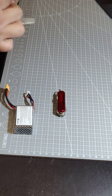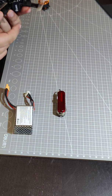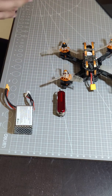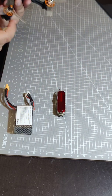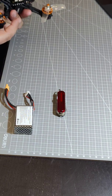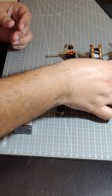However, when I was first setting this up, the VTX was a bit of a hassle. I couldn't get the smart audio working — it's supposed to have smart audio connected and you just have to go into Betaflight and configure it, which I tried to do but for some reason it was not working. I tried a bunch of things but I think my unit might just not be connected, so I'm waiting on the delivery of my soldering iron before I open this up and look inside.